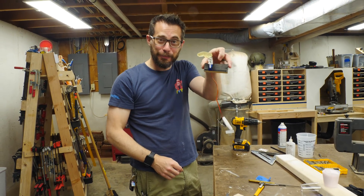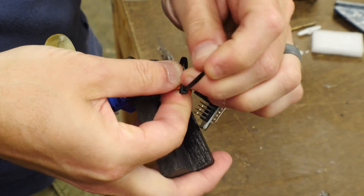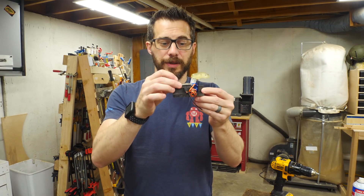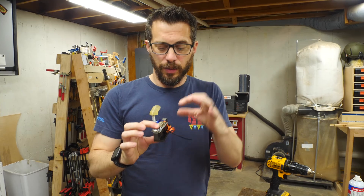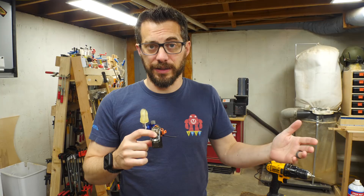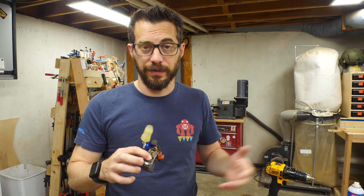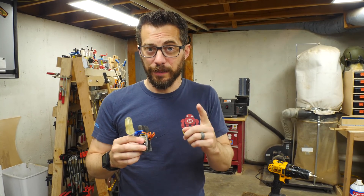I've made some ridiculous stuff, but that's pretty ridiculous, don't you think? I rolled up the servo wire and used a zip tie just to hold it in place. I'm going to hot glue this down, and while the hot glue gun is heating up, let me tell you the next step. Once you've got this thing programmed and it has a name, then you just say Alexa, Discover Devices. She'll find it on your local network and ask you to add it to your smart home stuff. Then you can actually just turn it on and off by name, but there's a way to make it even cooler.